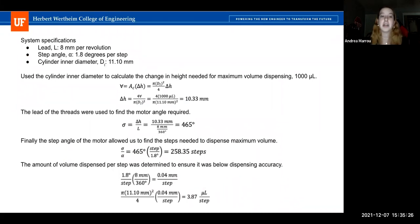After finding the inner cylinder diameter, we ensured other dimensions like the cylinder height. Using that diameter, we calculated the height needed to dispense the maximum volume of 1,000 microliters — approximately 10 millimeters — then added a few more millimeters for wiggle room. We found the motor angle needed, which was used as a starting point in our Arduino code, though we had to deviate from it quite a bit. We also confirmed that microliters dispensed per step was below the five-microliter dispensing accuracy requirement.